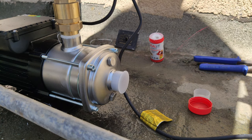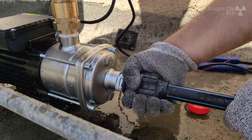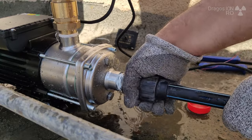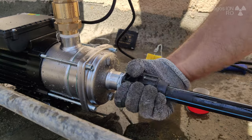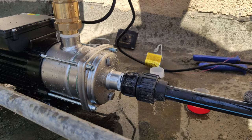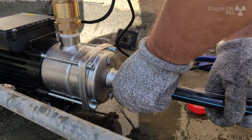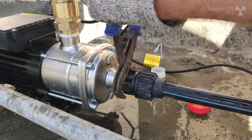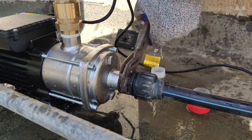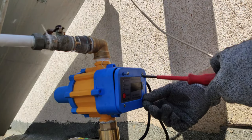Now we'll go to the inlet part, where the water supply comes from, which is in my case from the water tank. I also put the sealant on this threading - it's a plastic thread. The sealant has to be in the same direction as you spin it, so it doesn't fray when you insert it. I tighten this as much as I could with my hand and then I use the pipe wrench. Maybe I shouldn't have used the pipe wrench on this thing - this plastic is a bit soft - but I just want to make sure it's closed. No water leaks. Closing it properly, making it a bit dry before I go into the electrics part.